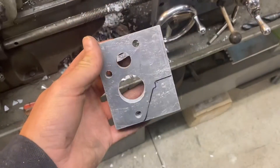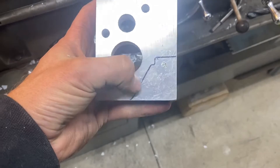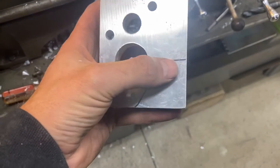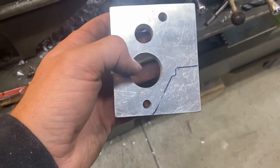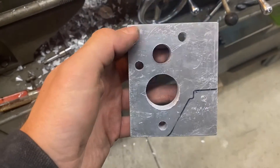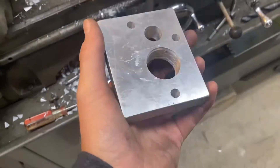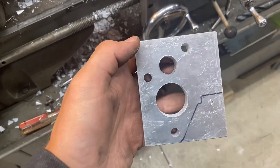I've got my holes drilled in this piece of aluminum and I've kind of got it marked here on the bottom corner. I need to cut this corner off to make room for the valve that's there on the engine block, and then I need to mill out a little bit here in the center. That's something I'm just going to do by hand so that the air will flow, because I'm going with a single bore carburetor but it's got to go to the double bore of the RE5. So next I'll make a cut and do a little machining here.